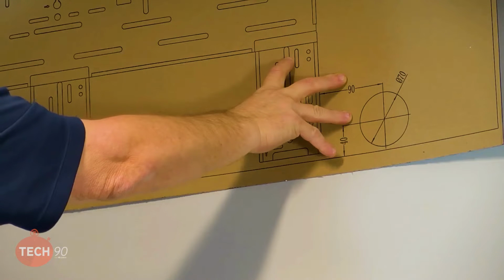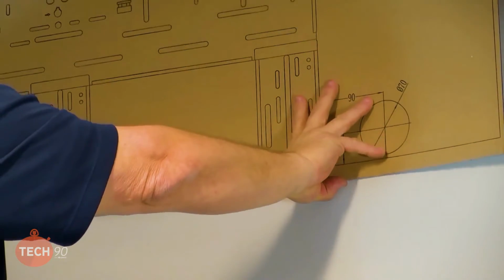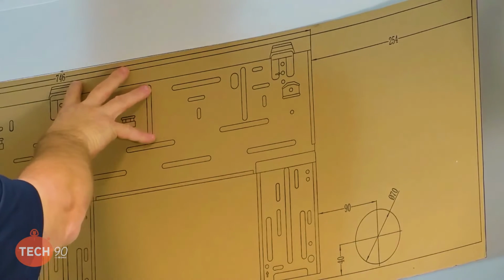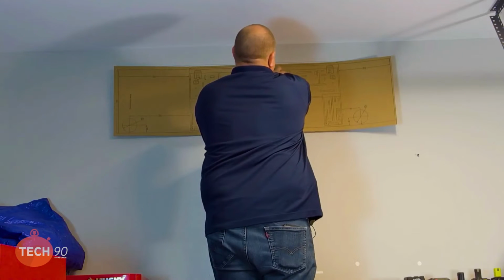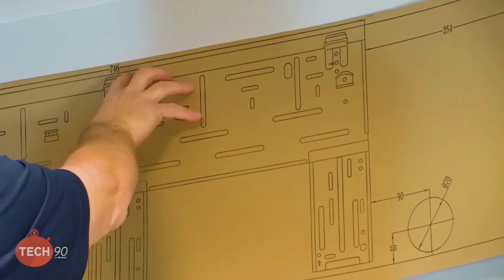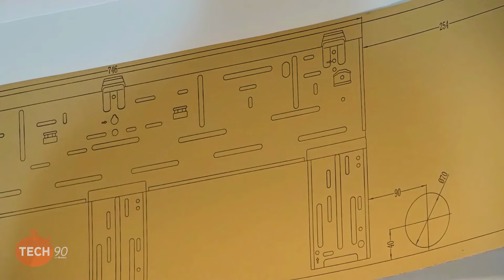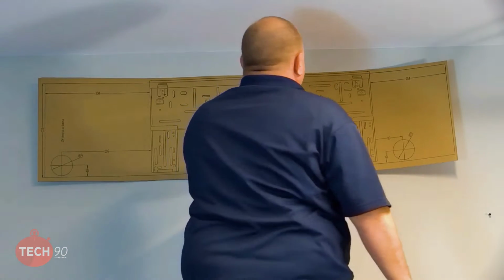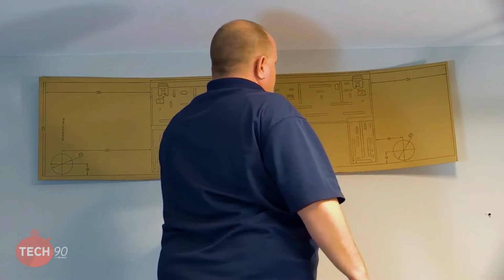So keep in mind on this template, the drawn lines on the top and the bottom are going to be your actual lines you want to stay within, not the cardboard itself. So actually I would want this up then about a half inch. So what I could do is, if you really want to be real accurate, and probably not a bad idea, if you just measure what this is, then you'll know how much further above you need to go of your line. Or you may even want to put a blade to that, just use an X-Acto knife and actually cut it off the exact height. That way you're not getting confused, because it looks to me like there's a little bit more cardboard on the left than the right. Then you could end up a little crooked.